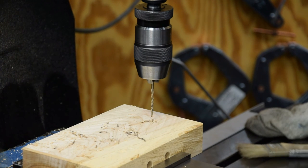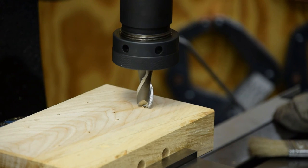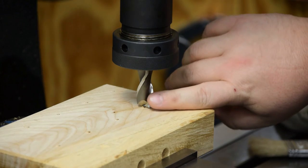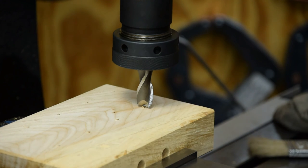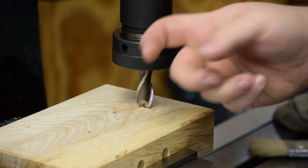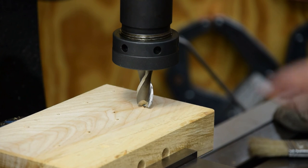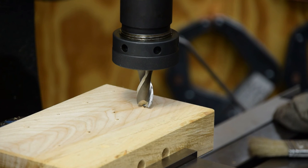Okay, so I got my tool changed. It's a 5/8 inch two flute, high speed steel, brand new Niagara. Man, it is just razor sharp. It's double ended, so I couldn't even put it in a collet. I had to hold it in this TG100 chuck. My collets aren't bored through, so I can't hold double-ended end mills in them, but these are too good a deal to pass up, so just have to hold them how I can hold them. I can use them with a CNC machine, too.